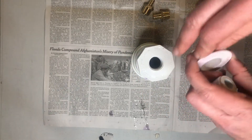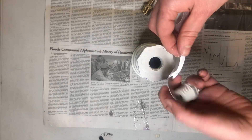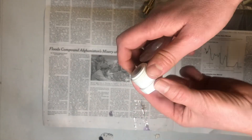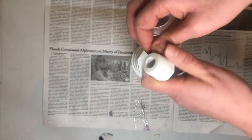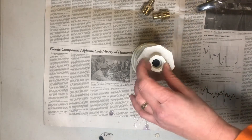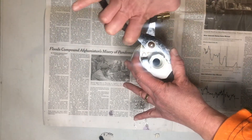This is the three-quarter inch to half-inch adapter. Threading tape works best if you use it like toilet paper — make sure the tail end of your roll is facing out and give it a few turns around the threads, smoothing it out with your thumb for a nice layer of threading tape. Make sure the threads are still visible. I usually go finger tight as far as I can, and then use pliers to finish the job.